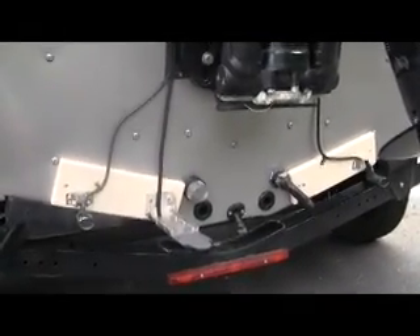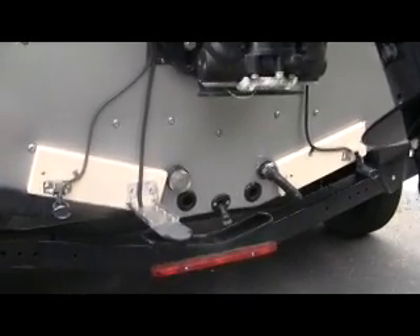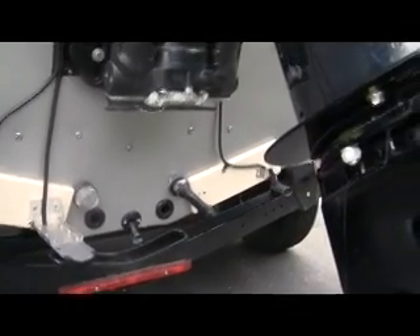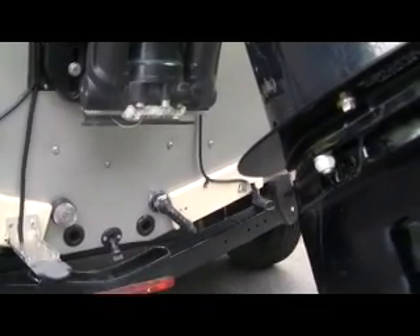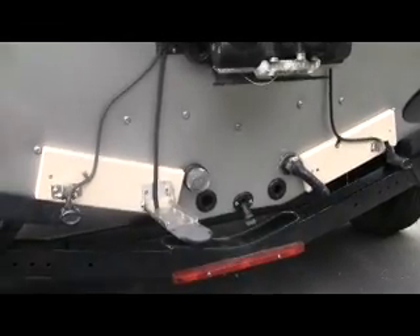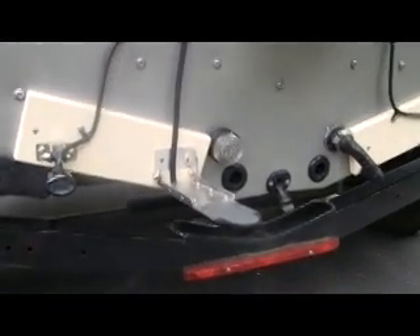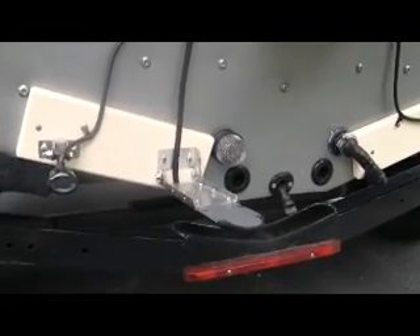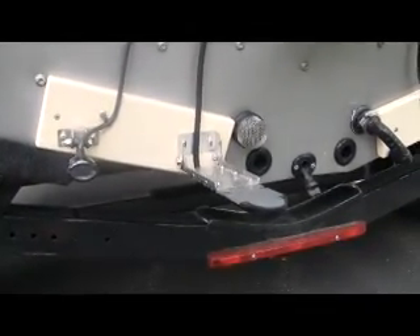Here you see my mounting plates. I like plastic mounting plates because if I don't get the transducer mounted exactly right, I don't have to drill any more holes in my boat — really nice. That is a Surveyor. The Surveyor is used to pick up water on the fly. Your live wells will not pick up water on the fly when you're driving down the lake at 50 miles an hour. If you put that on, it'll pick up water at any speed. When mounting transducers, just make sure that they're level and make sure that the little clam — like a half shell — is parallel to the water and below the bottom of the boat. With a Crestliner, you don't have to be as fussy about getting them deep because there are no rivets on the boat — it's a smooth bottom boat just like a fiberglass boat. But if you have a riveted boat, there's a row of rivets on the back and you need to get your transducer lower so that you can get those high-speed readings.